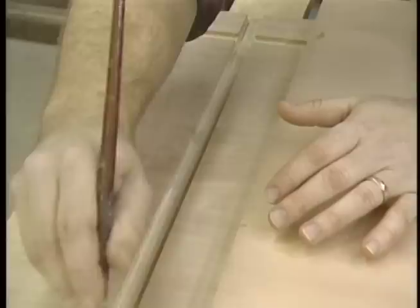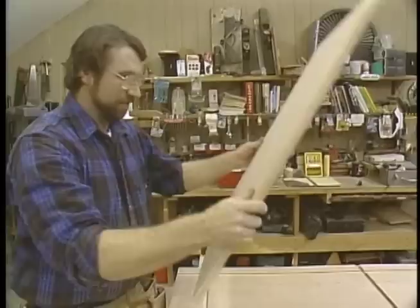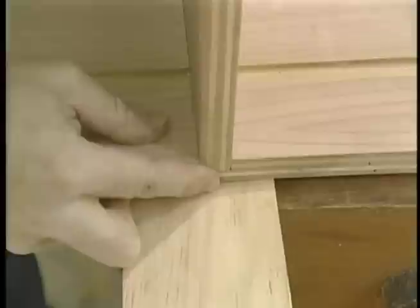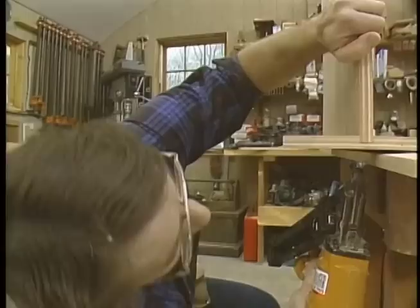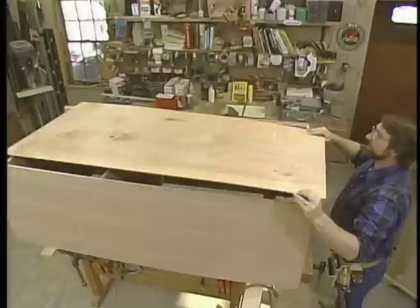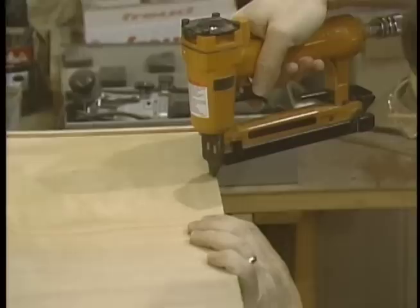There's no better time than right now to sand the inner portions of the cabinet, and to do that I'm just using a fine 150-grit paper. It's assembly time. A little bit of yellow carpenter's glue in that dado joint, and I'll just take my shelf and set it in the joint. If there's any variation at all, I'm going to let it happen at the back of the cabinet — I want the front to be perfectly flush, or else the face frame is going to rock on it later. I'll slide it out over the end of the bench a bit and tack it with a couple nails using my pneumatic nail gun. The back of the cabinet is the quarter-inch plywood, and I've got to make sure I put the cherry side facing in.